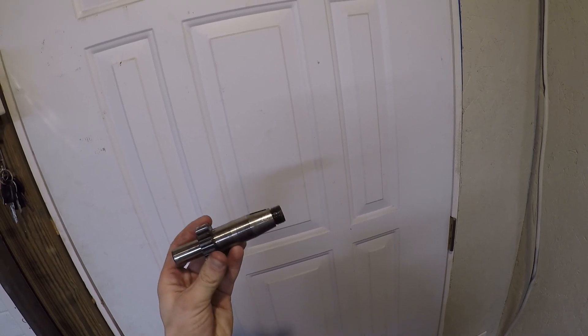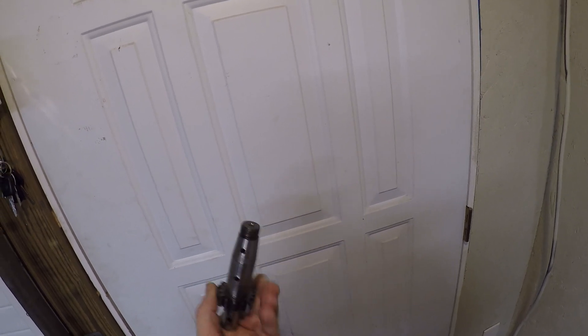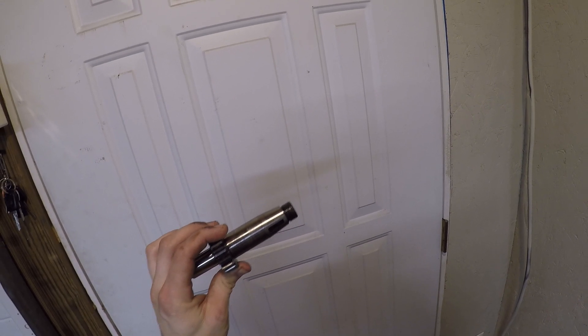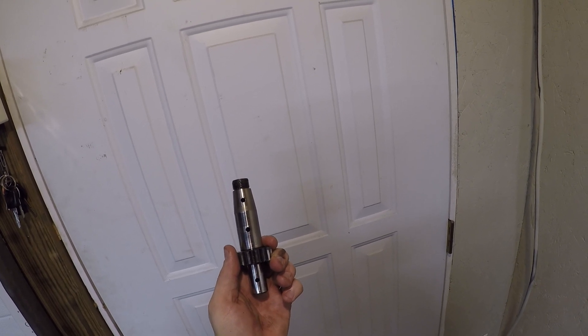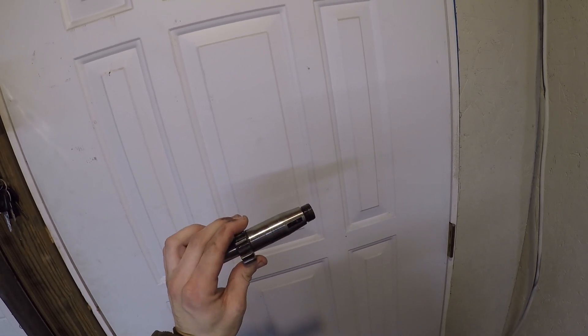While I was working I was thinking that one of the input gears people said you could use was like 40 bucks — wondering if this was worth a 40-dollar hassle. But now that I see this is one inch, it definitely is, because so is the output shaft of the Briggs motor we've got. So we might be able to just get away with a shaft coupler right onto this, straight onto the Briggs motor. That's awesome — that'll save us a lot of hassle, time, and probably money too.